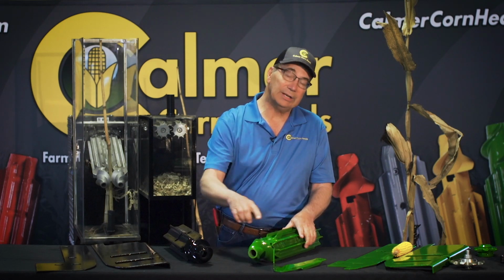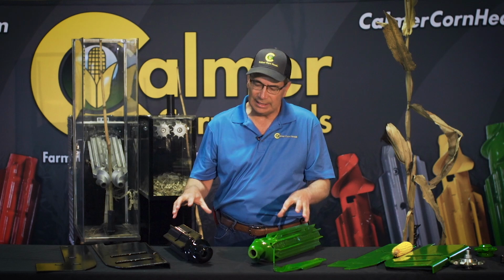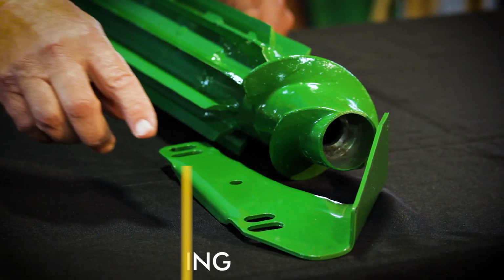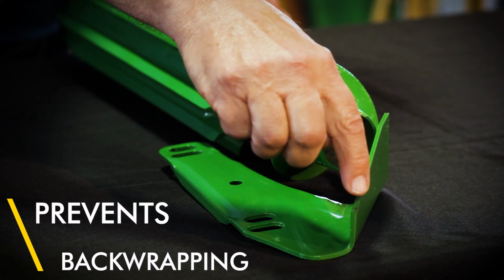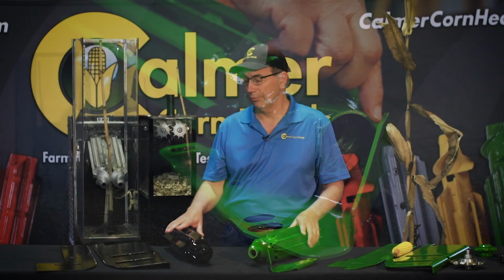We've also put a bead of hard surfacing on there because as farmers, we know that that's the area that's going to wear out first. So we're trying to be proactive and make this stalk roll last as long as possible. So that's the main upgrades that we have on the stalk roll. There's also a weed knife that goes around the spiral there that would stop any grass from wanting to wrap, especially on that outside round around the field or going through a waterway.